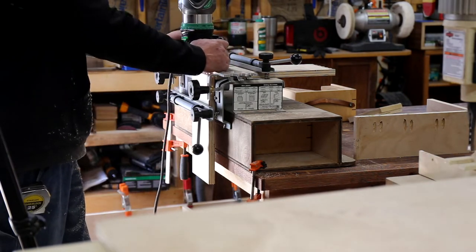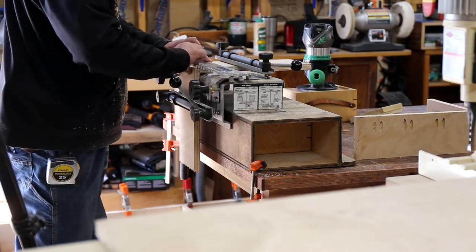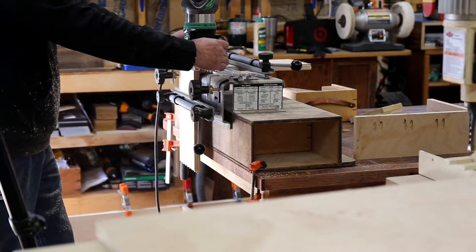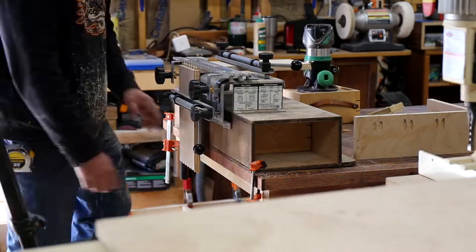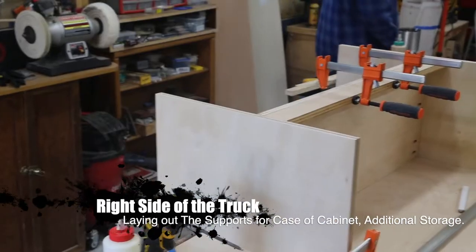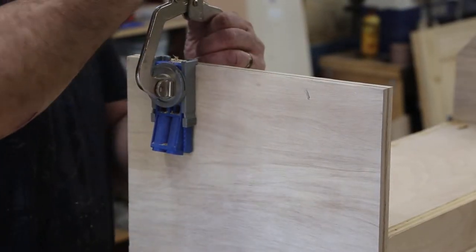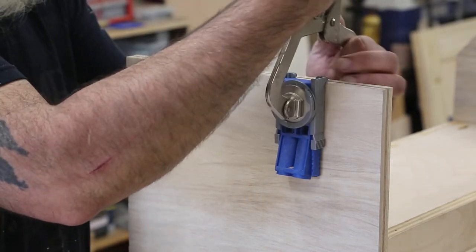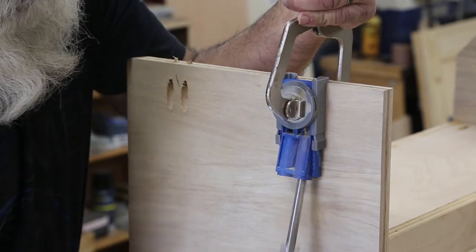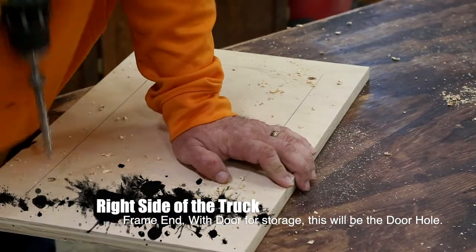Anytime you're trying to square something up or make it look nice, you can cut the majority of the hole out with a jigsaw — it doesn't matter if it's straight or crooked — we're going to straighten it up in the end with a flush trim router bit. I'll put a link in the description where you can get one; it's a tool we use quite regularly on a lot of our build outs. We're going to make those cutouts for the access points to the shelves and cubby holes so it looks factory clean. Same as with the bed, we'll do a dry fit and make sure everything fits together before we glue and screw it all.